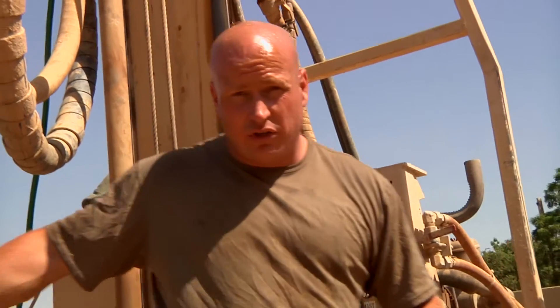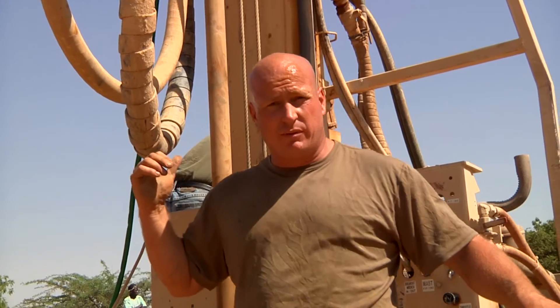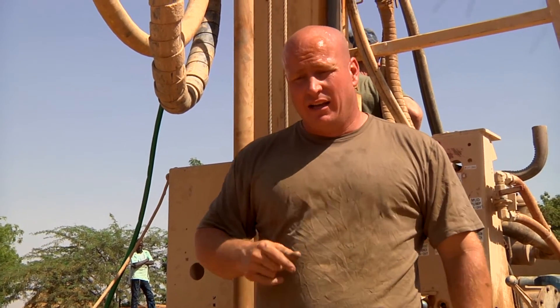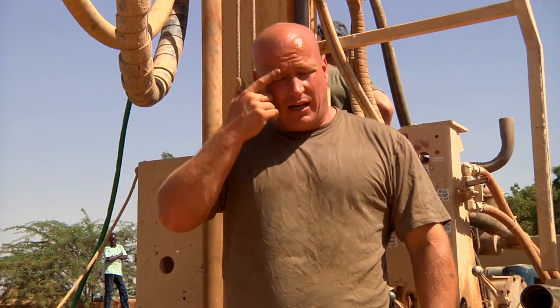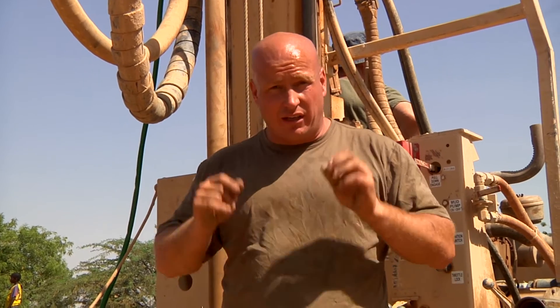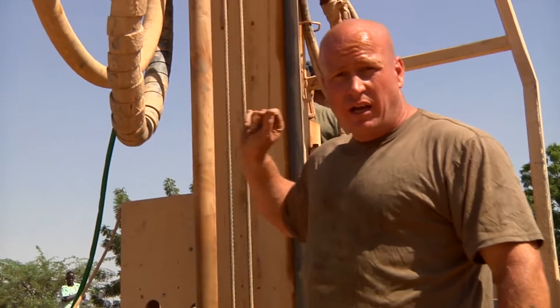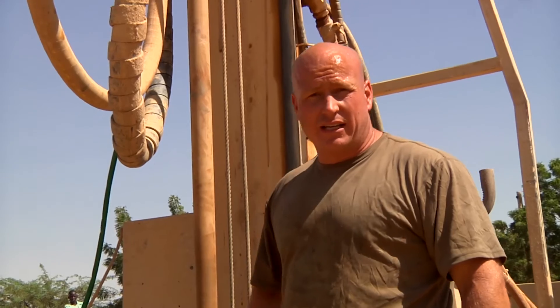We do all the on and off control over at the air compressor, not at the little adjustment valve. Once you've got that adjustment valve set, we like to leave that be — do all the on/off at the air compressor so there's no fidgeting around trying to get it timed right. Once it's set, leave it set. As you go deeper — down in that 80, 90, 100-foot range — you will have to adjust it to make sure your pulse is right. As you go deeper you've got a lot more pressure pushing back, so make sure you're sending enough down to do the job. Always keep an eye on that — if you're drilling from here you can always see the green hose and watch it surge. Remember, a surge about every three seconds is right.